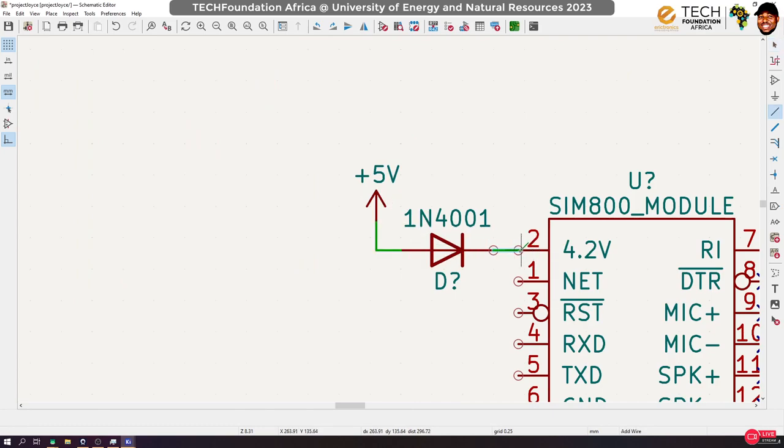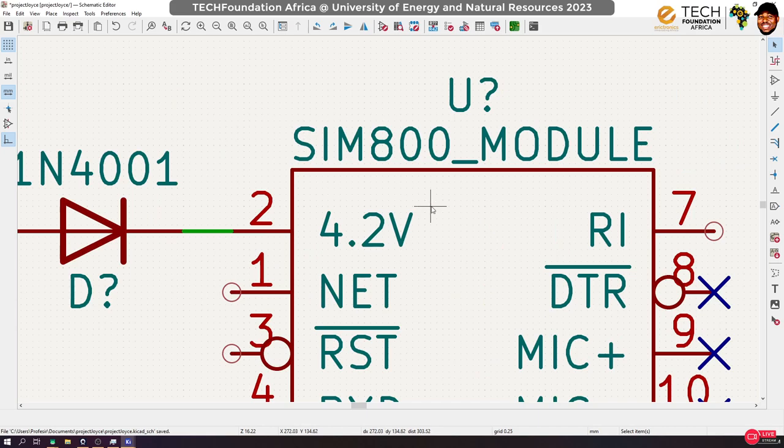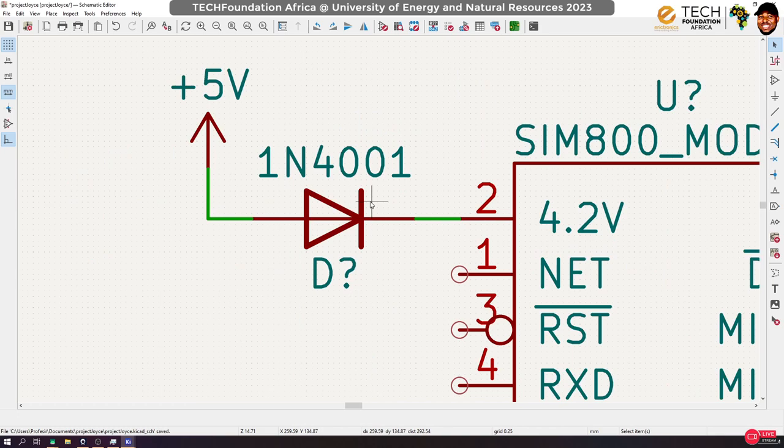When we do this, what will happen is this: when this 5 volts comes in, the diode, because of its forward voltage conduction, which is about 0.7 to 0.8, is going to drop 0.7 out of this and give us 4.3, which is actually ideal for our SIM. But this diode can pass just about one amp, and like we said, this can spike and demand 2 amps. So technically doing this is not ideal. So what we can do is